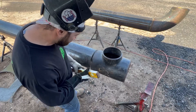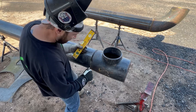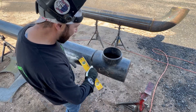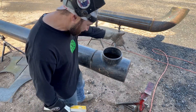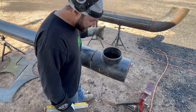You've got to make sure that when you're welding your tacks, just don't over-tack it. Pick your big side and go. You're going to have to roll it on its side and make sure it's still level out here for the pipe. Because sometimes at this point you might have to stick a wedge in it, get it to where you need it, and then run that weld.